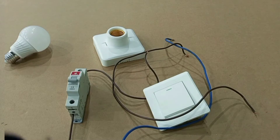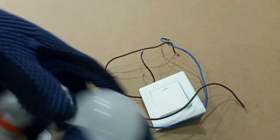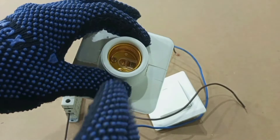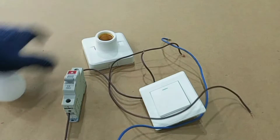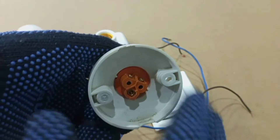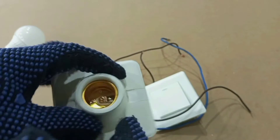This is a short video to explain how to properly wire an E27 lamp holder. An E27 lamp holder is one where the lamp is screwed into the holder, unlike the normal B22 where you just push and lock the lamp. The E27 holder has a thread, and the part of the lamp that goes into the holder is a screw. When wiring a normal B22 lamp holder, live and neutral can be connected to any terminal — it doesn't matter. But for the Edison screw type lamp holder, the connection is different.